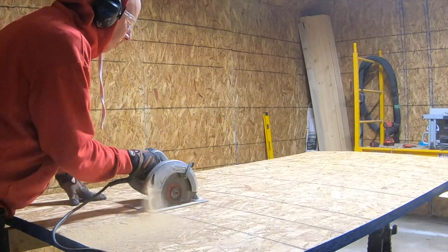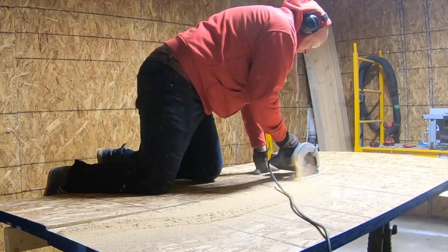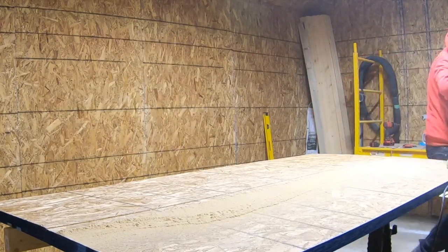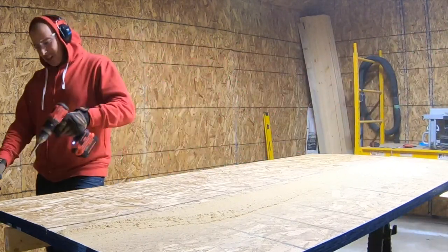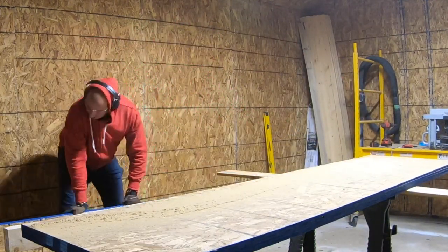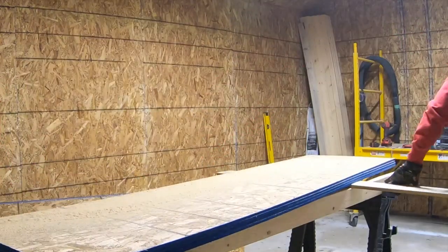For most economical use of the OSB or plywood, I'm ripping the shelves down to 24 inch. I will end up with 8 pieces at slightly under 24 inches. Other economical sizes would be 12 inch or 16 inches. Try to make 12, 16, or 24 inch work for the depth of your shelves to not waste plywood or OSB.